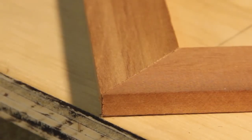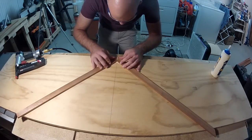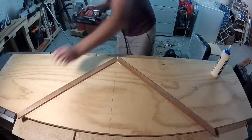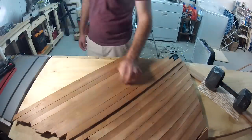To fasten them to the board I'll use a little bit of wood glue and a brad nail on either end. If you have a pin nailer, use that instead as they leave a much smaller hole. I don't have one, but I'll show you a solution on how to patch the holes later on. Next, just keep making those cuts and repeating the previous steps for all the pieces inside the initial strips until you've created a large triangle.